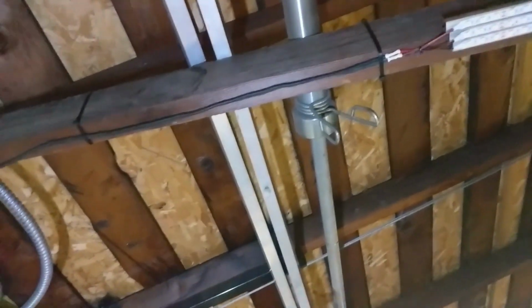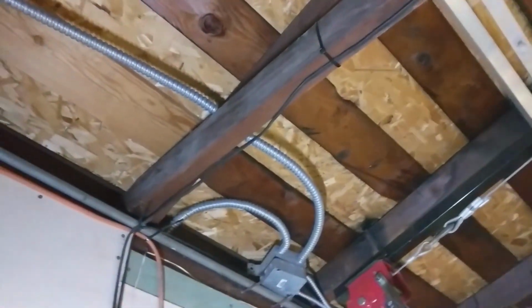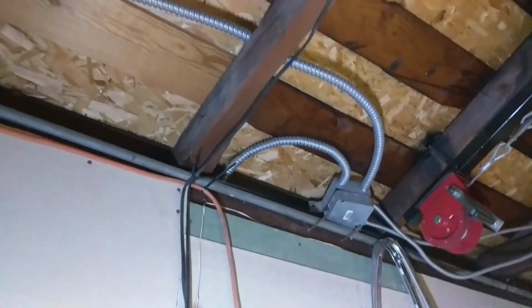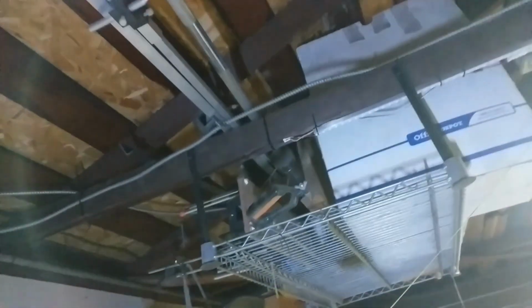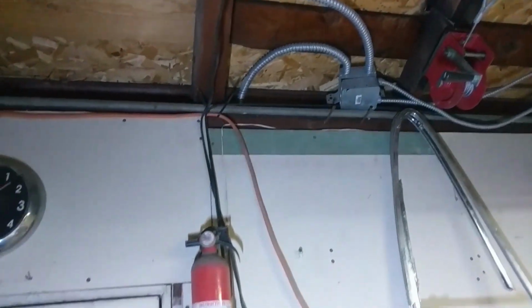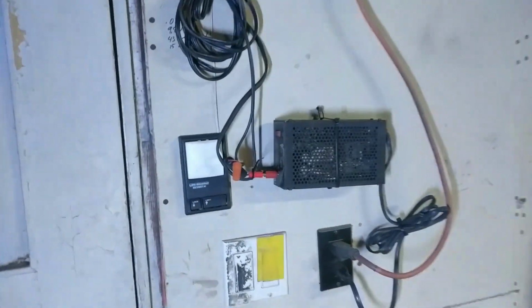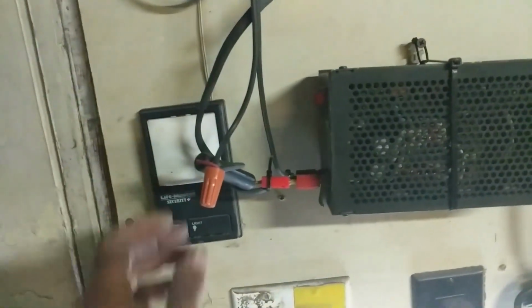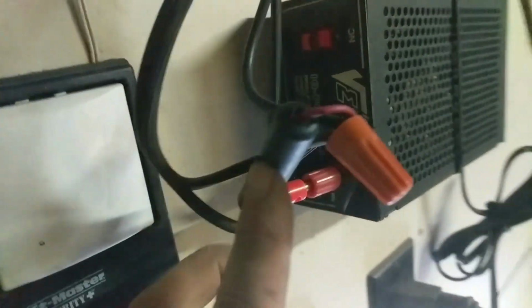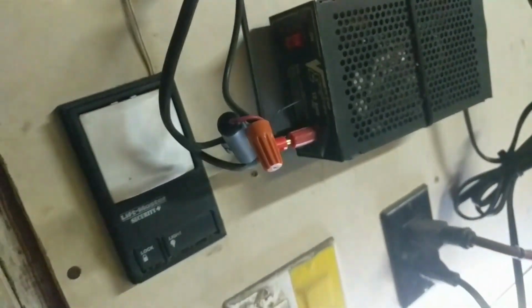That's landscape wire, so low voltage wire for outside lighting. It's pretty heavy duty. I think it's 16 gauge. And so there's two sets of wires that come down, head over the top of the roof there, and then come down to where my switches are, kind of a rat's nest there, and then hooked into my power supply. I did decide to go with an inline fuse. This is just an automotive fuse. There's a 15 amp fuse there, just for a little extra safety.